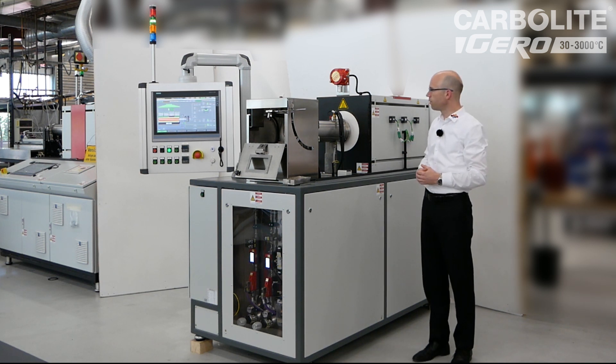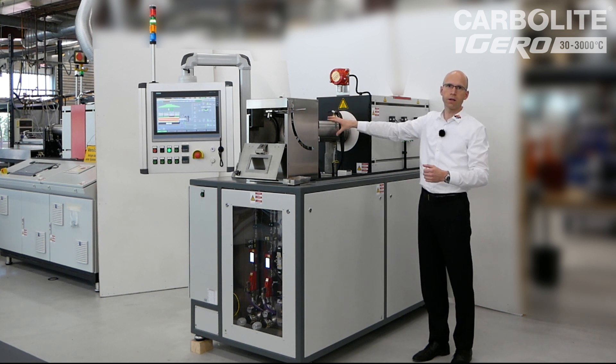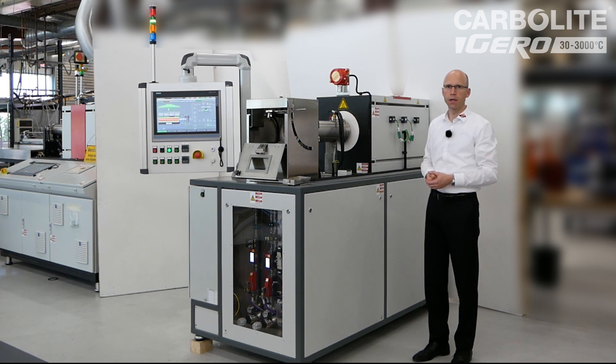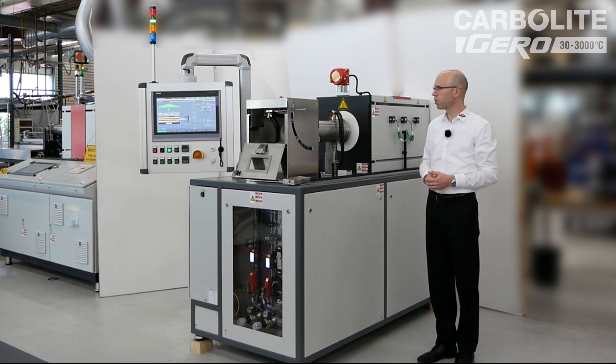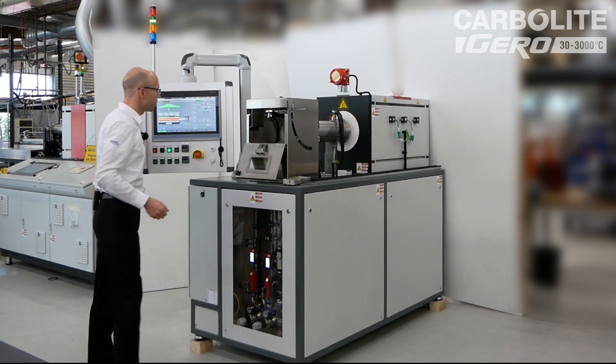What is so special about this tube furnace? We can transfer a sample manually from the hot zone to the cool zone, and again from the cool zone to the hot zone. Everything is possible by manual manipulation. Everything is possible under nitrogen, but also under full hydrogen — and this is what makes this furnace so special: manual movement of samples from hot to cold in a full hydrogen atmosphere.